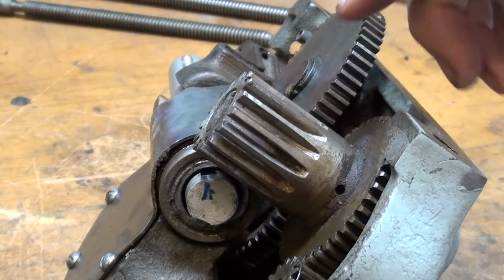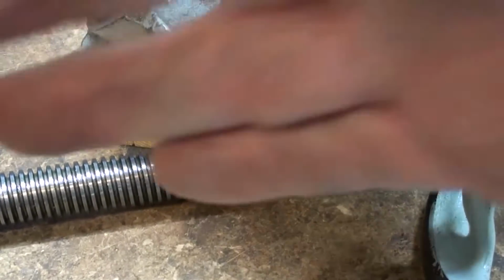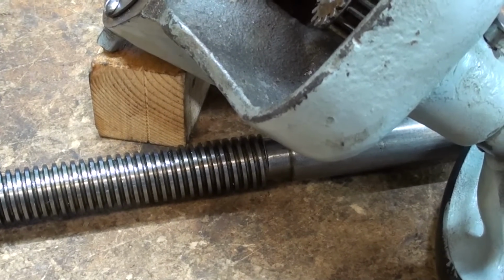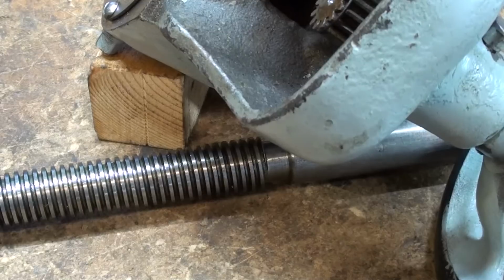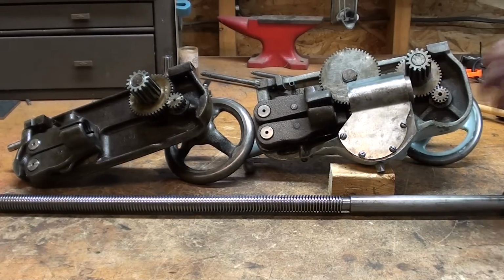Now, this system prevents wear on the lead screw, so the lead screw stays accurate and is used only for threading and never just for the feeds, although we are using feeds much more often than we are cutting threads on most machines. Okay, I think I've explained enough the purpose of what I'm doing here.